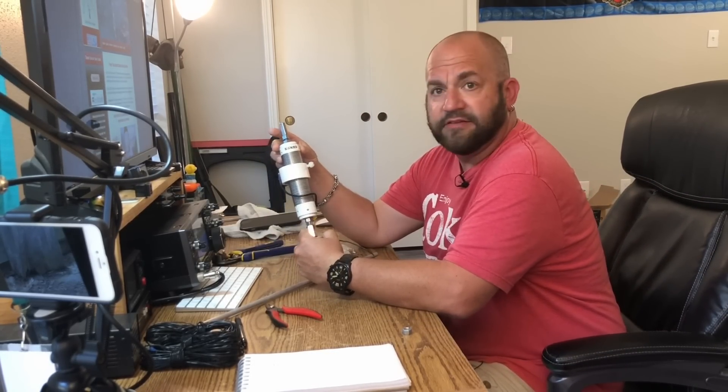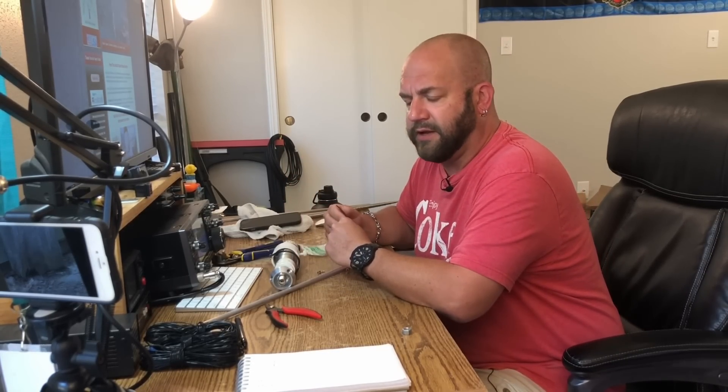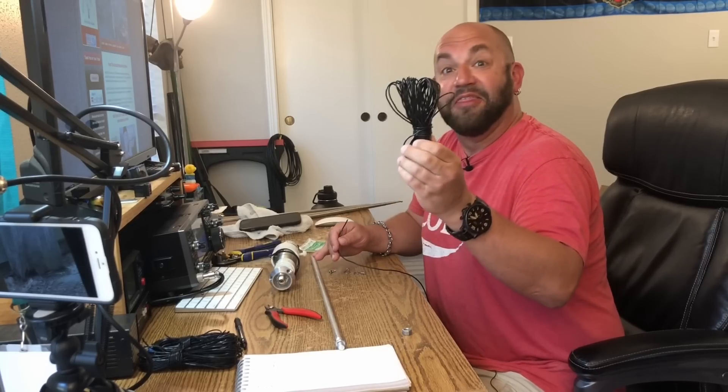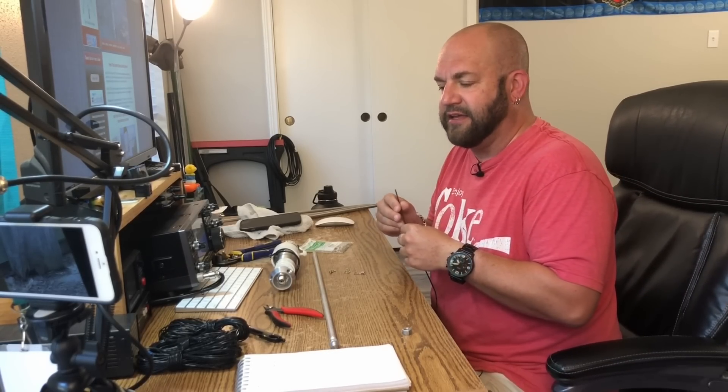The Wolf River Coils is a fantastic antenna I've praised many times, but something has been festering in my mind for a while. Based on how we build the DX Commander, Callum's research found that it doesn't matter so much the length of each individual counterpoise wire as the overall length. The Wolf River Coils has three 33-foot radials, but that takes up a 66-foot radius in the field. I'm wondering if we could use more but shorter counterpoise wires.